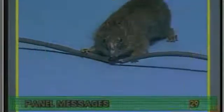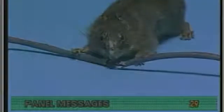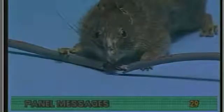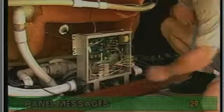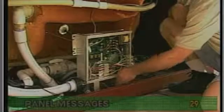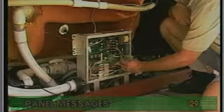In the event that you suspect sensor failure, first check sensor wires for cracks or teeth marks indicating the presence of a rodent. Trace the high limit wire back to the heater and inspect the wire for damage due to an extreme overheat.